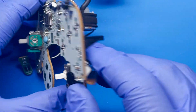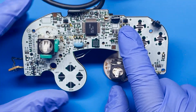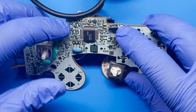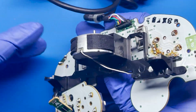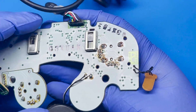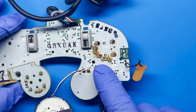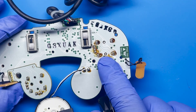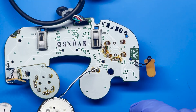Normally this joystick is blocked by this black plastic housing. In order to remove that, there are two clips located right here and right here. Simply push this down and then push outward, and this should release the black plastic. At that point you should have access to the joints here for that joystick. You can see here there's some old flux that's just kind of leftover. So let me go ahead and get my desolder gun prepped and we're going to start removing this.